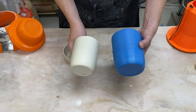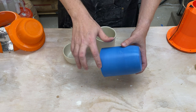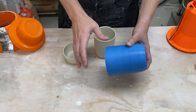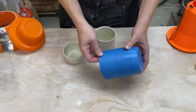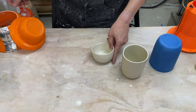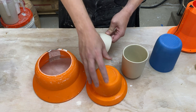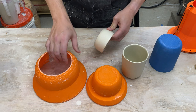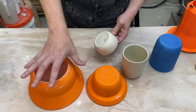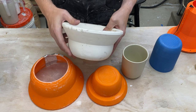This here is the mold I used to create this pot. What I did was I basically sketched the outside form that I wanted and I had some software that I'm working on create all the 3D printed pieces I needed. This one I printed out and created in a more or less traditional way. I then made some improvements and created this mold here for this small bowl. Similarly I have an inside mold that creates the form, but I also created an outside mold so that I can create a plaster slip casting mold that uses less plaster and it's just nicer to use. So here is the associated plaster mold.